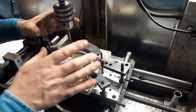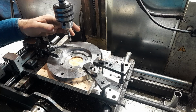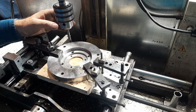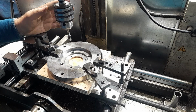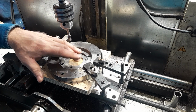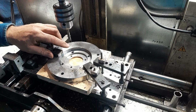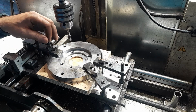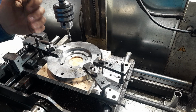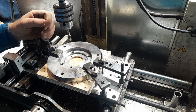And hopefully I've got enough meat in here and enough clearance room to where I can mill pockets for the pinions to clear. So I'm going to go ahead and get these holes tapped. I'm just going to start my tap down in there, about 3 threads, and I'm going to hand tap it. But I'm going to do all that off camera because I'm sure you've seen how to tap a hole and break a tap off before. With this set up on my precision piece of plywood, it's really not going to tap well. I don't have a helical tap, just a plug tap. So I've got to run it down, back it out, run it down, back it out. That's not going to tap really great. So I'll do that off camera.